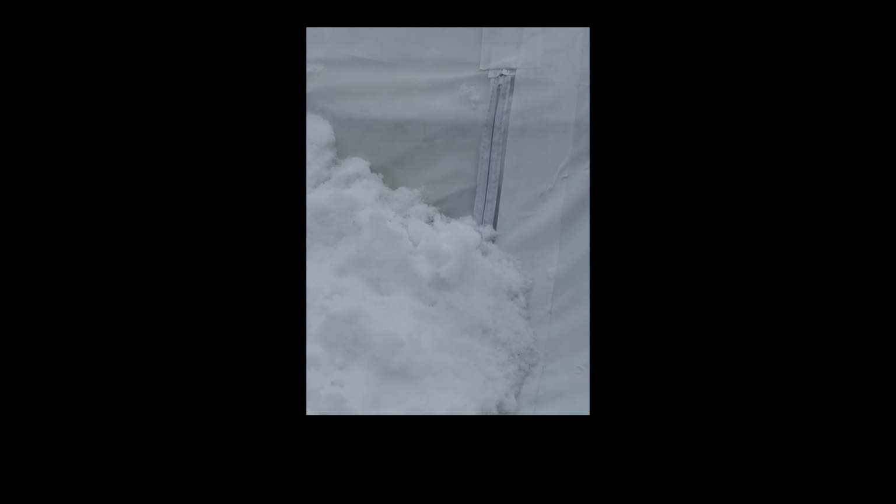So what I'm going to do today, after taking all this stuff off, is take some irrigation hose like you would use for a sprinkler system, which is pretty strong stuff, and arc it from the starboard to the port side underneath the shrink wrap, to give it some more structure to help shed the ice and snow better as it accumulates. But that's, there again, one of the reasons why, even though I never expect there to be any issues with the shrink wrap, I come out here at least every couple weeks just to check and make sure. Had I let this sit and continue to accumulate, at some point it may have been heavy enough to cause the shrink wrap to fail. So just FYI, if you shrink wrap your boat, even if you have somebody else shrink wrap it, it's still a good idea to come out and check it every now and then just in case.